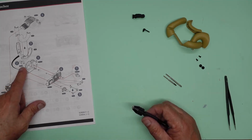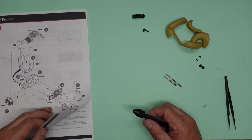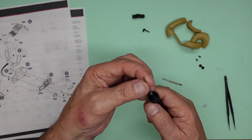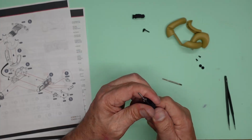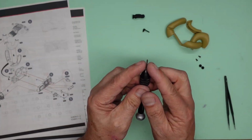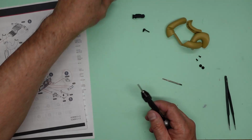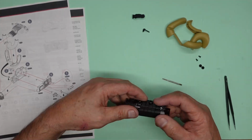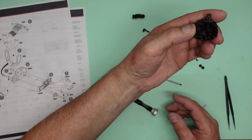So DCB8 and DCB8A both have J screws going in them, and the J screws were, as we know, 2mm. So I've got a 2mm tap here. This is a second tap. I know that Daryl's been asking me about this. You get a first, a second, and a bottoming, or a taper, second, bottoming. A bottoming tap is threaded right the way to the end and will cut if you have a blind hole, which is a hole that doesn't go right through. I can't see any on here. I don't have any blind holes here, unfortunately. Here you go, these are blind holes.